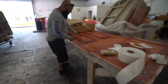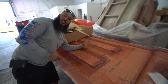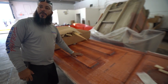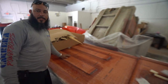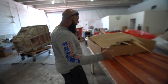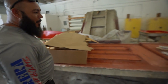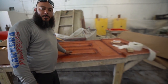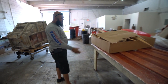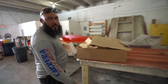Even our big hatches — see these two ribs added to the middle? It's a big surface that doesn't sit on anything underneath, so nothing supports it. We go in with a three-quarter inch foam, and we also added these ribs to make it extra durable so you have no flex. We're big boys — we can stand on this, we can jump on it. But with these big areas, we always try to reinforce and put ribs in so there's no type of flex.